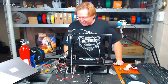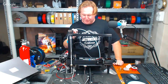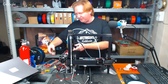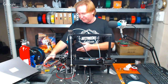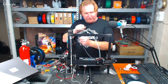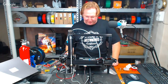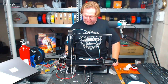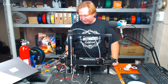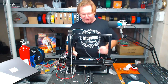But yeah, that's definitely one thing I would have really liked to see them do, like what G-Tech does on theirs, where they have the 4-pin ATX connector on the power board. That way you just take your power wires from your power supply and plug them right into the circuit board instead of having to do the set screws and all that. That's the weak link, I feel, in this whole setup. It would be nice if they would change that a little bit and go with just an ATX connector and be done with it. Even if they brought it out the bottom of the circuit board and it plugged in, they could still put the acrylic piece on the front of it.